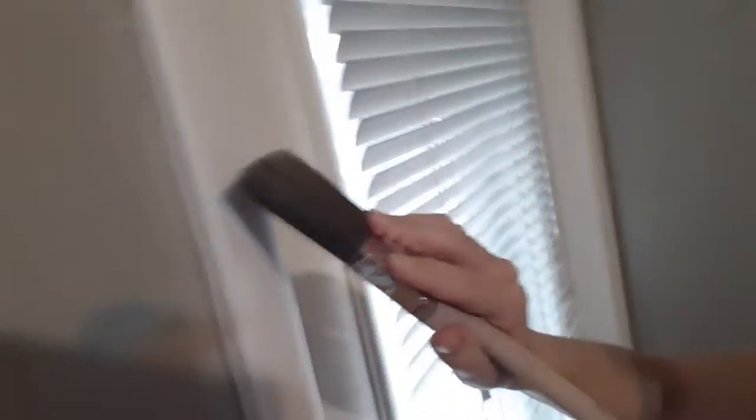When it comes to doors — and you said you were doing doors and windows and stuff with trim — all you have to do is get a bead on the side and pull it down. Just like that, lightly, but not so it's dripping. Try not to leave drips. If you've got drips, you've got too much paint. That applies to rolling too. If you do it with a brush and it drips down, you've got too much paint on your brush — just a light bead. Not much more than this much on the brush. Go light for your first time.